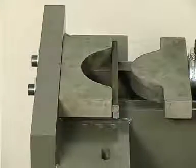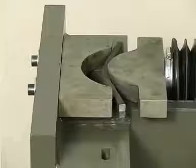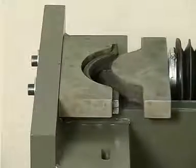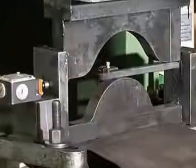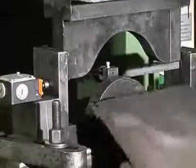The twirls are made either from pre-bent twirl blanks or from straight square rods. The twirls of the Glazer wrought-iron articles are all manufactured from pre-bent twirl blanks. The blanks are either cut to length and bent using the hydraulic unit, or cut and bent in a single process using an eccentric press and a special tool.